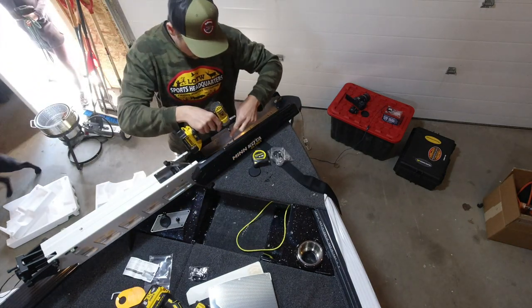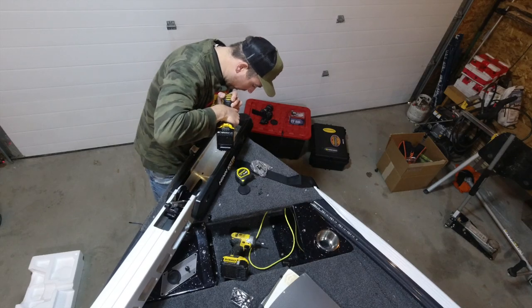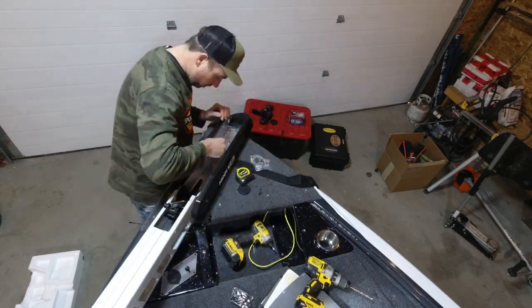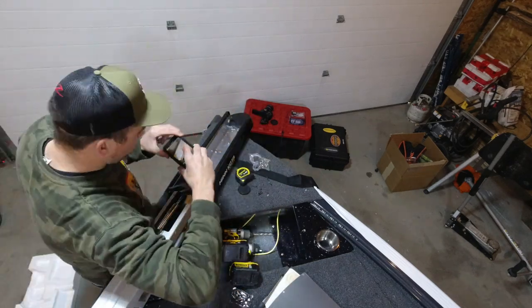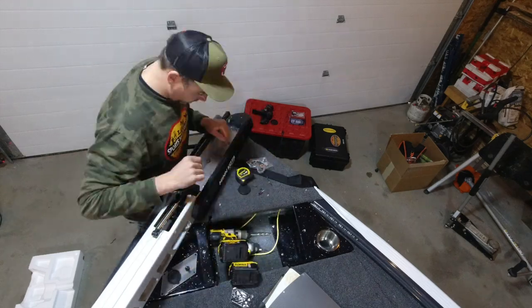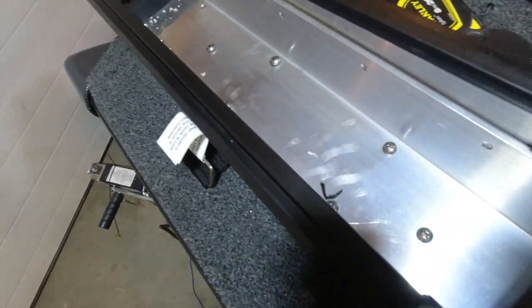These new Lunds — there's no wood left in these. This part used to be wood with a sheet of aluminum, but this is all just metal now. Keep that in mind when picking your drill bits and adjust your drill speed accordingly. I've got one bolt in, and I'm going to keep going until I have half a dozen holes. There are these pre-drilled holes in the bracket — don't be afraid to add your own. These ones up front I'm not going to be able to use because they're into the gunnel, so I'll probably put one in the middle.